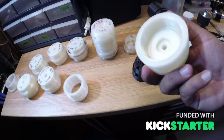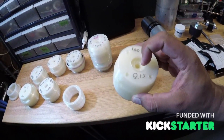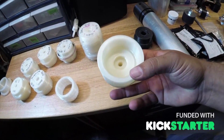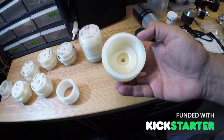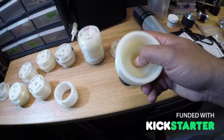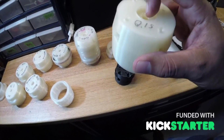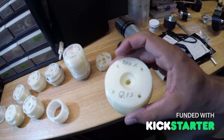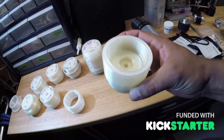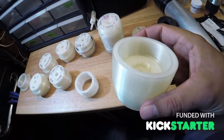After that one piece was done, here is the prop assembly. We've got a space here for a shaft seal and another shaft seal space in the back inside as well. If it gets warm and pressure builds up, this inside seal would actually push even harder and create a seal — whereas if you just did a seal on the outside, pressure buildup could pop and blow the seal out. This piece is 100% infill and quite heavy, with a round O-ring seal inside.